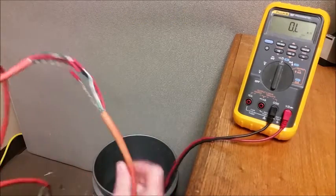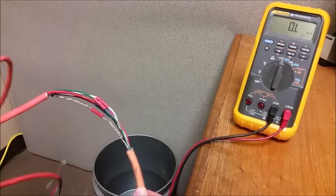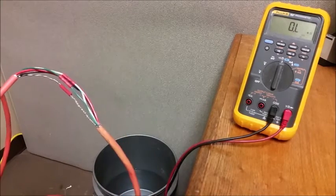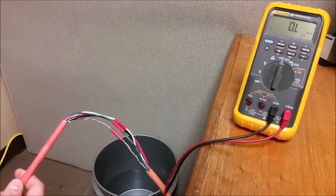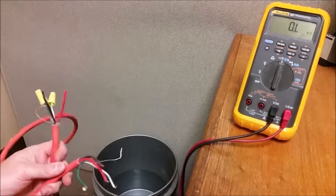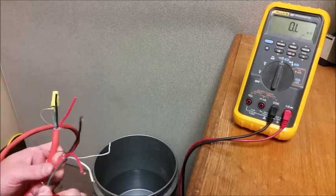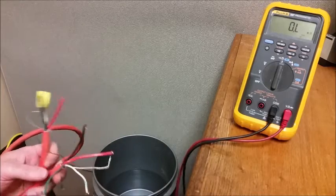And the cable, we've got both spliced together, is open, because it'd be kind of hard to simulate a wrapped jacket, but the principle is still the same as far as seeing that water ground or even corrosion at this point, creating an increase in resistance between the conductors. You'll see what I mean. So here's our two ends again. Here's our resistor. We're going to do basically like we did before. Measure on the conductors of the communications without touching anything else.